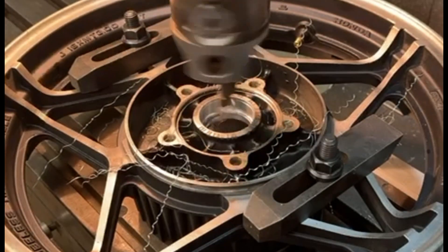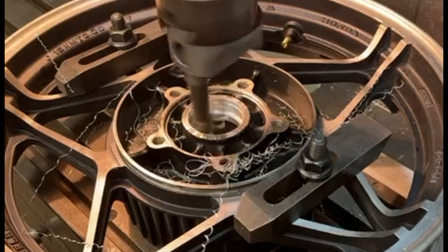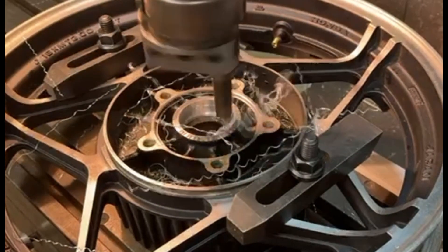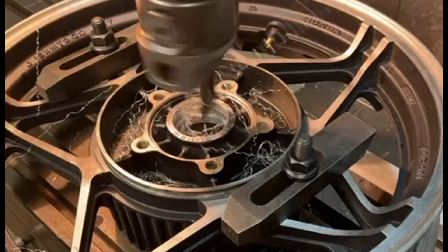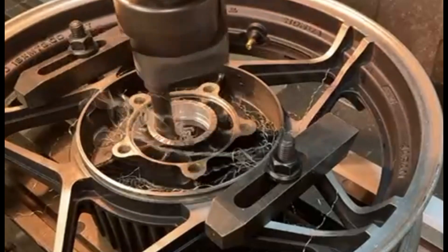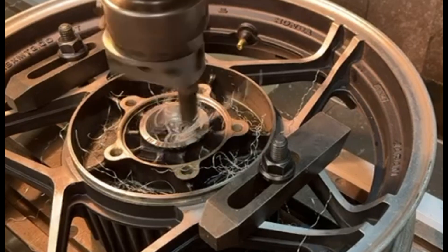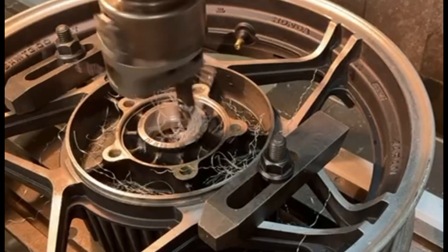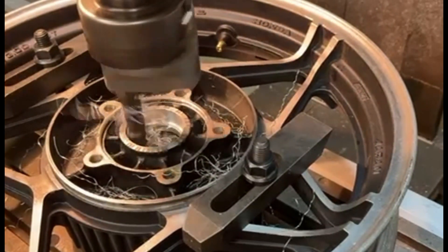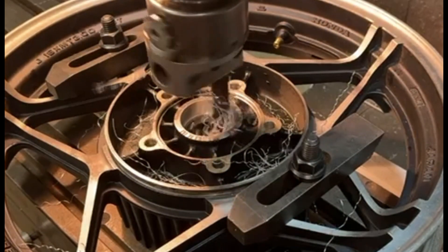Here I'm just taking the final cut now. It's getting very close to the size I want. Earlier I mentioned I was taking this down to the width of the bearing, but actually I'm taking it down about 20mm so that the cup — or bush — that I make to fit in there will be a cup shape, sitting down inside and taking the bearing within it. In the meantime I'm taking more or less a finishing cut. It's cutting quite nicely and I'm getting a nice finish. There's one thing about my old Beaver milling machine — it might be getting on in years but it still works pretty well; it's a fairly accurate machine.